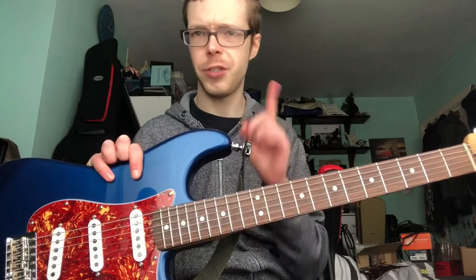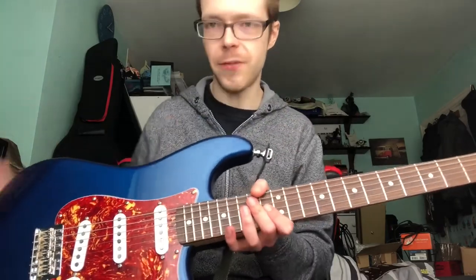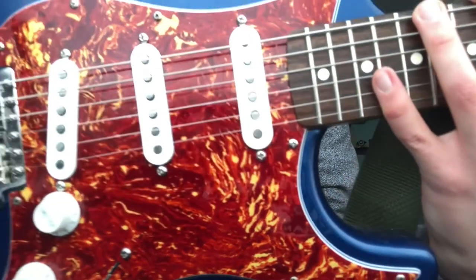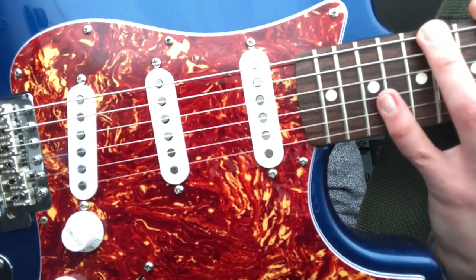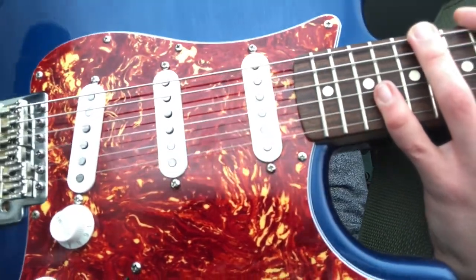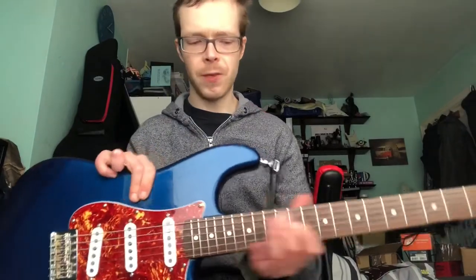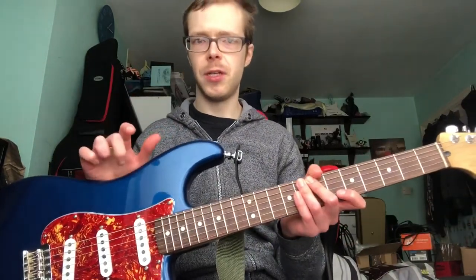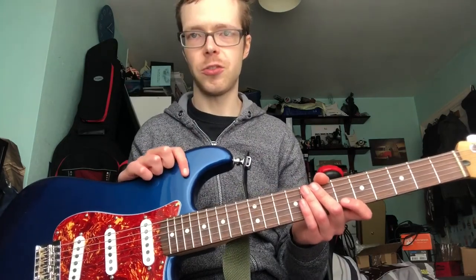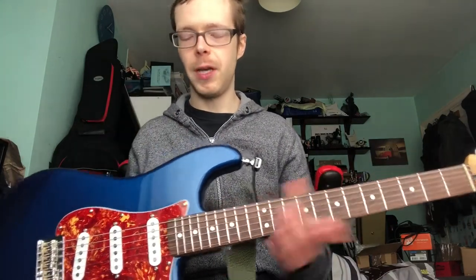Out of interest, I'm pretty sure they have Alnico slugs. These have Alnico slugs. You can see because of the dark grey colour. Can you see that? The dark grey colour on the slugs, almost like graphite from a pencil, that sort of colour. Which is very, very different from the chrome-dipped slugs with the rings on it that you get on this stock pickup. So the construction is entirely different. But anyway,